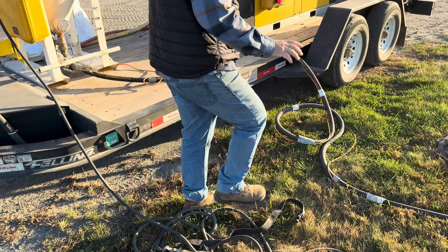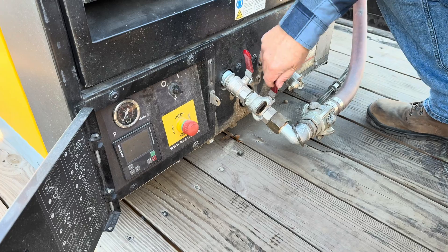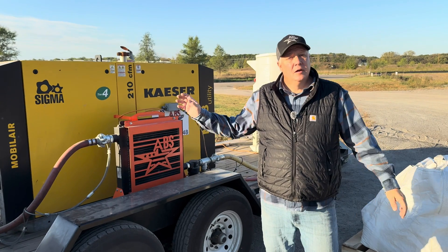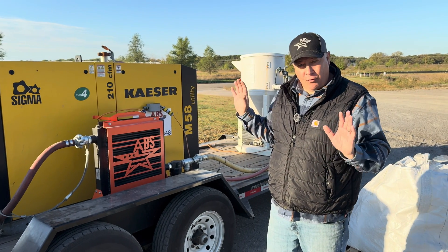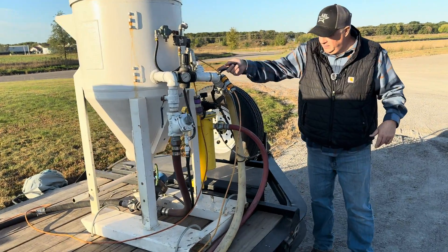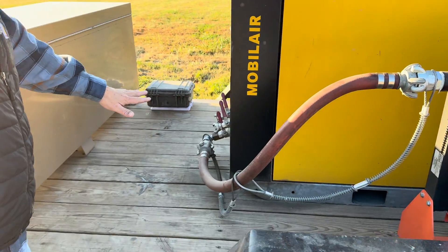We've got our helmet and our blast hose. Everything is good. Now we're ready to try and start the compressor. I'm going to make sure that my line is shut off so I don't get surprised by air coming out when this thing loads. Green button. We got the compressor started, had a couple minutes to warm up, and just loaded it and energized the air. Now before I go live with any air, I want to double-check all my components and make sure my ball valves are closed so I don't get surprised by something turning on automatically. My ball valve is off — air cannot go by here. Everything is connected and safety clipped.